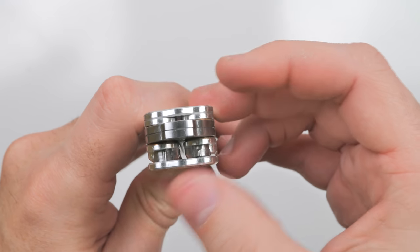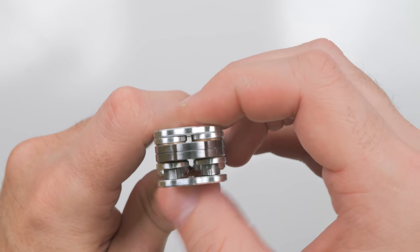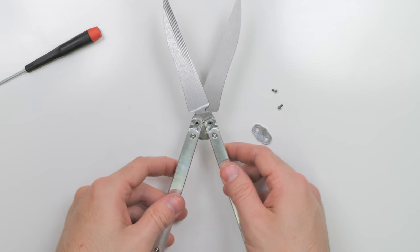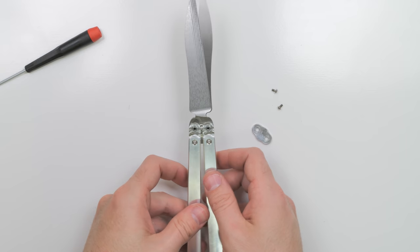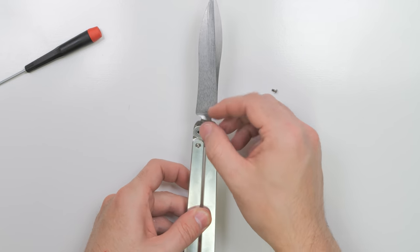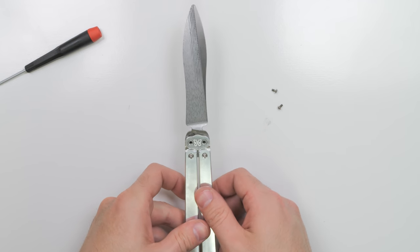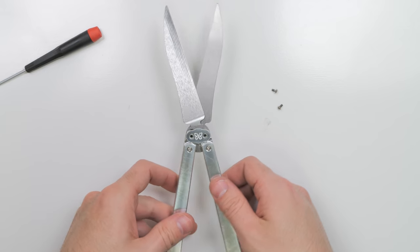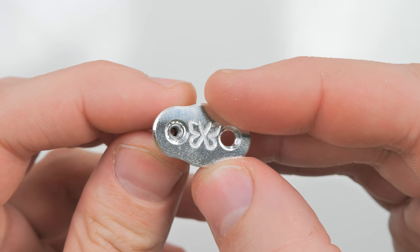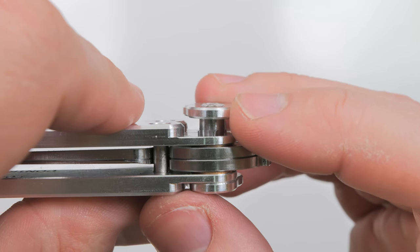One of the issues the button can have is if you push one side more than the other, it can parallelogram and get stuck. The pins need to have some freedom to move relative to the button in order for the scissors to be able to open and close. But I designed the pins and button so that they couldn't move up and down because of the screws holding them in place. I tried to design, make, and measure parts better and better, but I'd still sometimes end up with way more play than I expected.